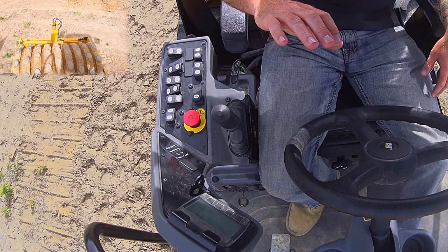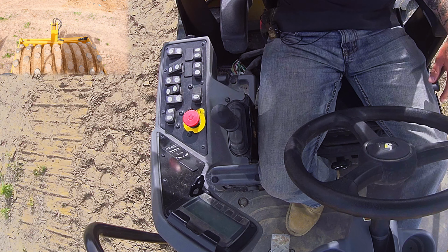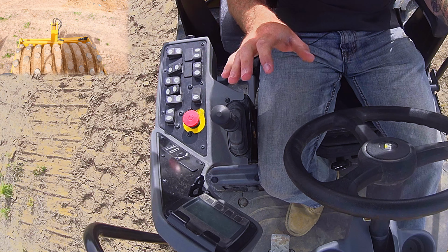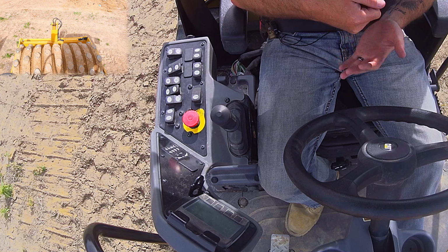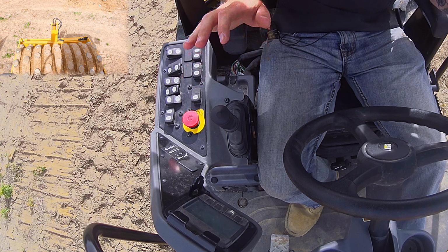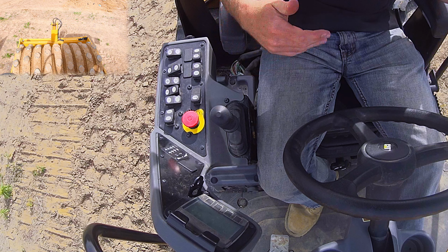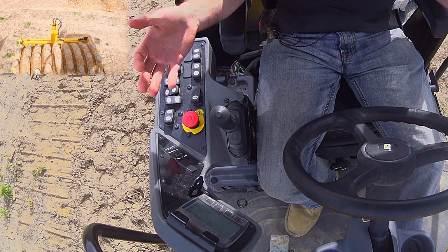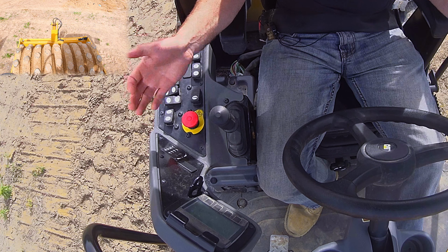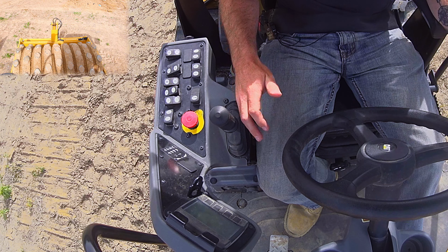As well as the other thing you can adjust on rollers, which is frequency. That's how fast it's hitting. If we had a very low frequency, it might go, and this is super exaggerated, it's never gonna go this slow, boom, boom, boom, boom. And if you had a high frequency, it's boom, boom, boom, boom, boom, boom, boom, boom. That's frequency adjustment. From what I understand, if you hit the right frequency for the right material, you can create a resonance that helps the material settle into place. I have yet to find anyone on any job site anywhere that can answer when and how you determine what frequency you should hit at.